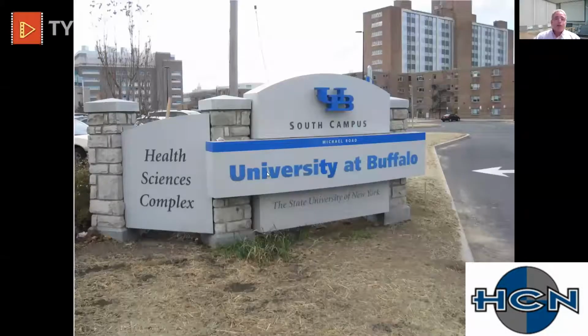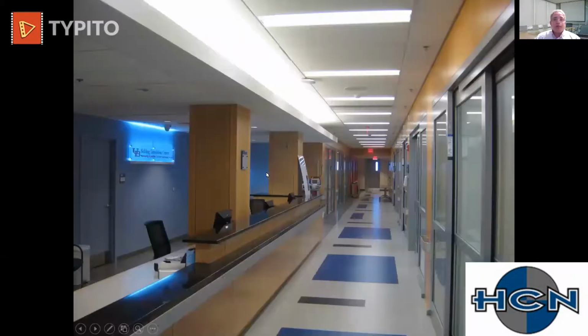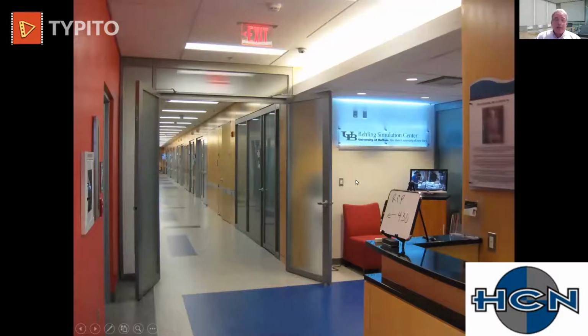Okay, so University of Buffalo, we do a lot of university work. They have linear units in the ceilings. When we do advocate for multi-fin diffusers, when possible, they perform better. When you CFD model it, you can really see the performance difference compared to a single slot diffuser that's just shooting that air across the ceiling line.